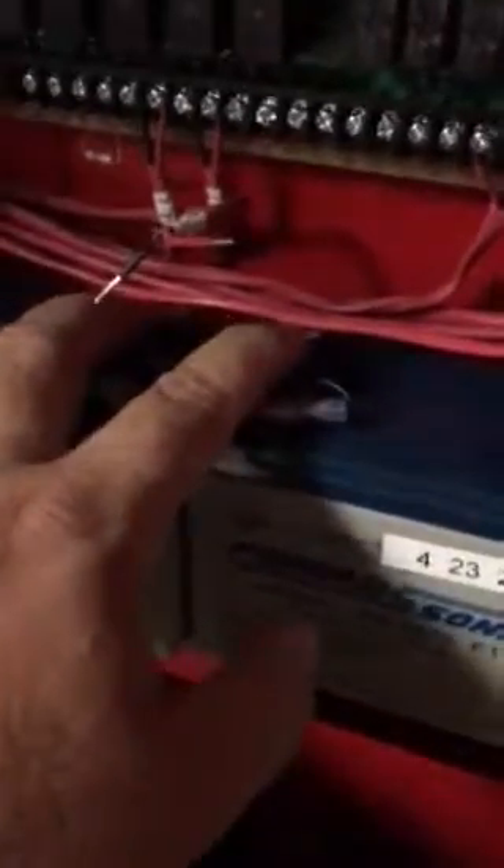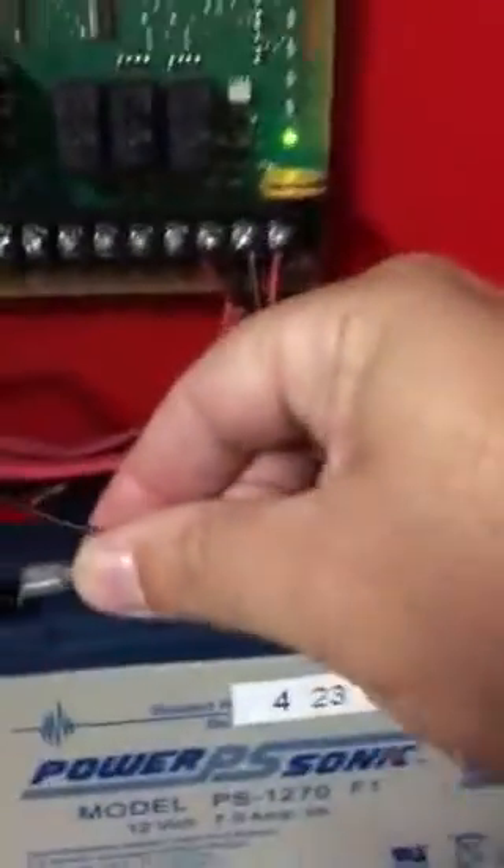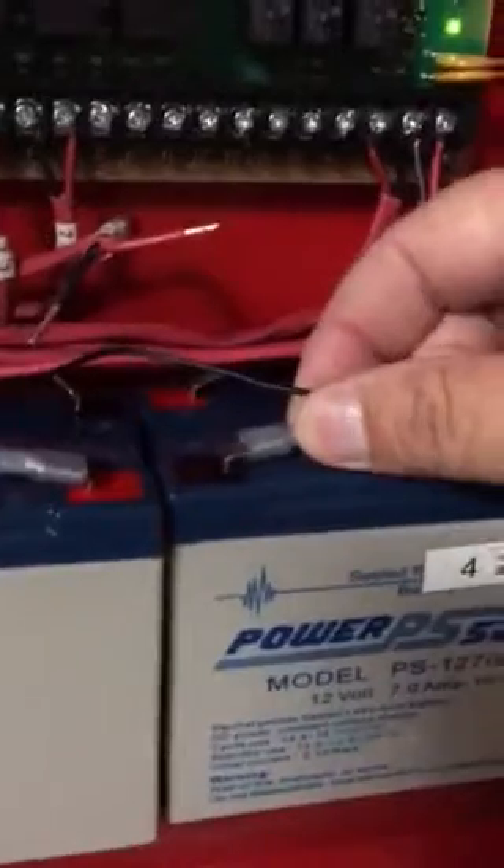So I took a set of the batteries from down here, brought it up top, and stuck a jumper wire in between to get my 27 volts. I noticed that's loose — might have crimped that. You see stuff like that; it just kills you. That's the best intermittent trouble just waiting to happen right there.